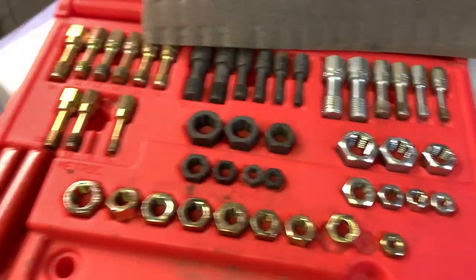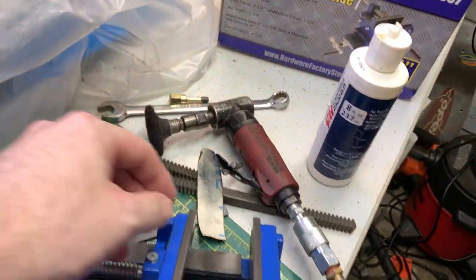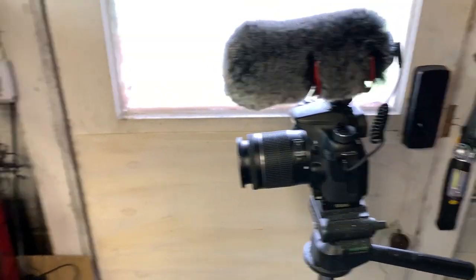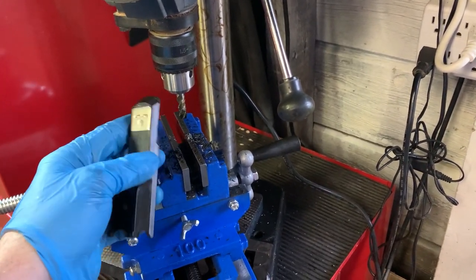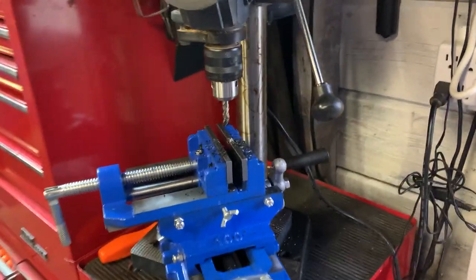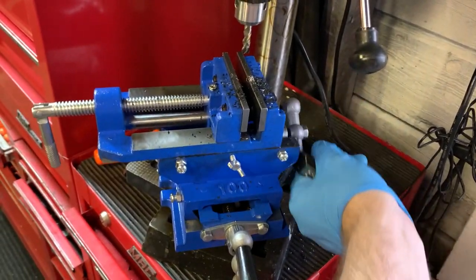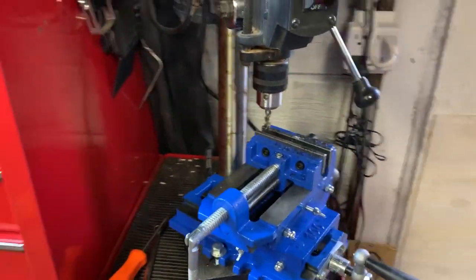Like everything cheap, you better be ready to spend some time on it. This is going to be a video in itself — roll-lock discs, emery cloth, taps, chasers — and we're not done yet, but it's coming along. I shot the video and got this thing all cleaned up and mounted, and I'm able to mill plastic with it no problem. Soft materials are where it's at for this thing — aluminum maybe — but it's still a functional drill press. I've got a milling bit chucked up with full function on my axes, nice and smooth now. For a $70 item, it is what it is. It's a poor man's milling machine — super happy.